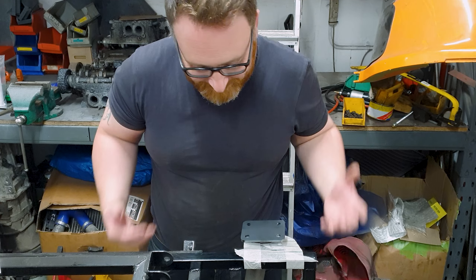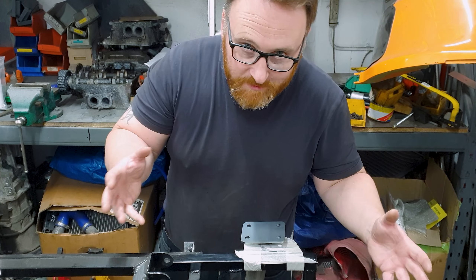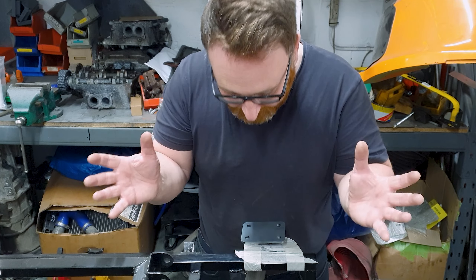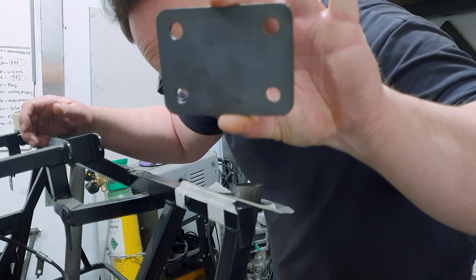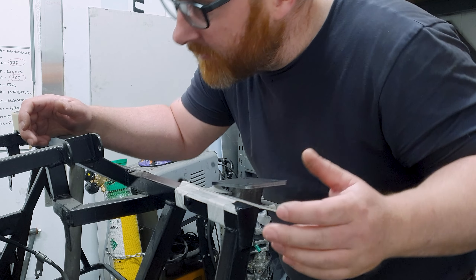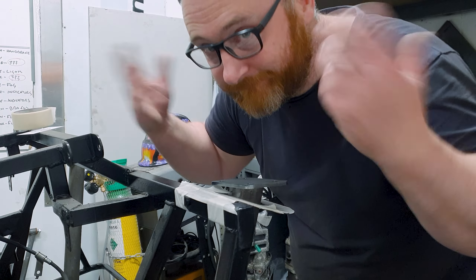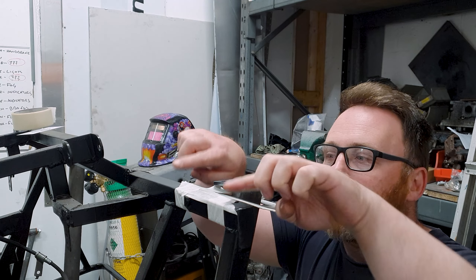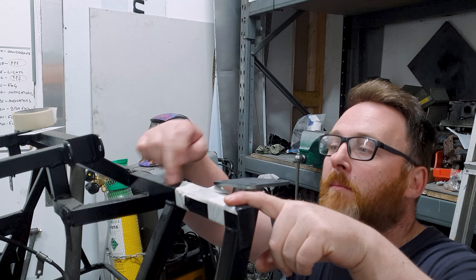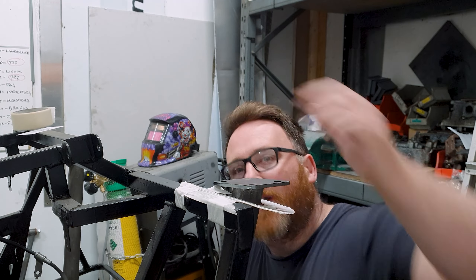Six months for a montage. Yeah, that — Supra, all the Supra stuff. Started the episode before that and this is us now, so apologies if I've forgotten a few things. These guys have been the missing link as well — I forgot to order them in while I did the Supra stuff. Pay close attention: it's a 6mm thick plate, very nicely laser cut, fits perfectly, I've got four of them and I paid a grand total of 12 quid. How much time and money would that have cost me to do myself? This little solution is going to go on here. I'll need to flatten down and level this off so the plate sits completely level with this bar, and then onto this bar we're going to weld another plate so the whole roll cage is still detachable.